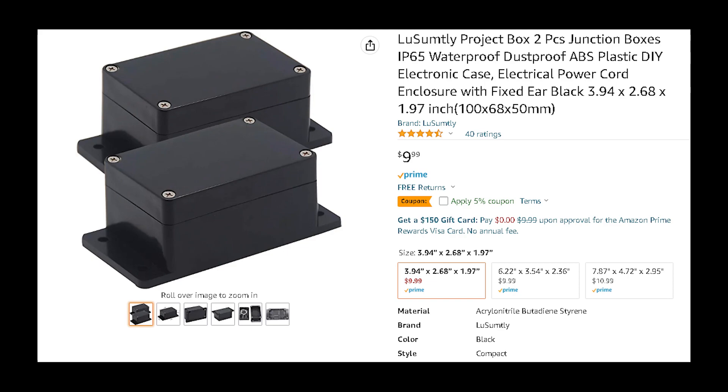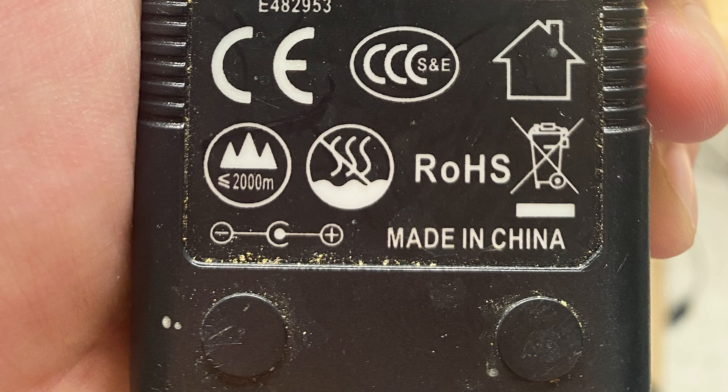If you were hoping for a more in-depth visual representation of how to do the physical parts, we're going to cover some of this during our soldering and project-building video that we have planned. We found too many errors within our prototype one to say 'do it this exact way' yet. For example, how is this not shorted out yet? But you can see that the one with the little rivet is going to be the center post, and the other two are going to be the outside barrel. You should always double-check with your power supply which is which — here you can see that the positive is pointing to the center, whereas the negative is a C around it. Always double check this when you get new equipment, as suppliers can change over time.